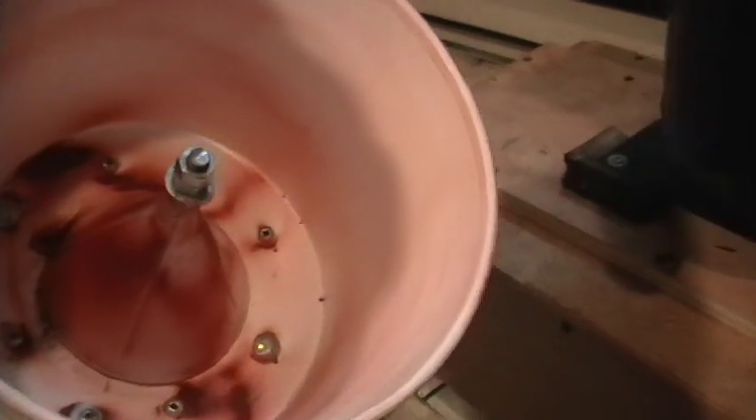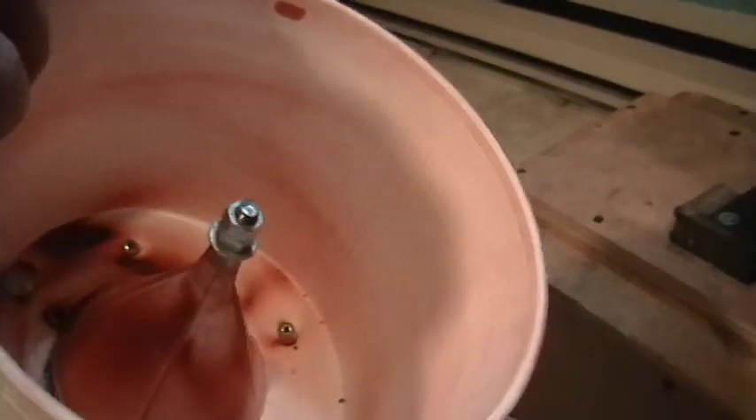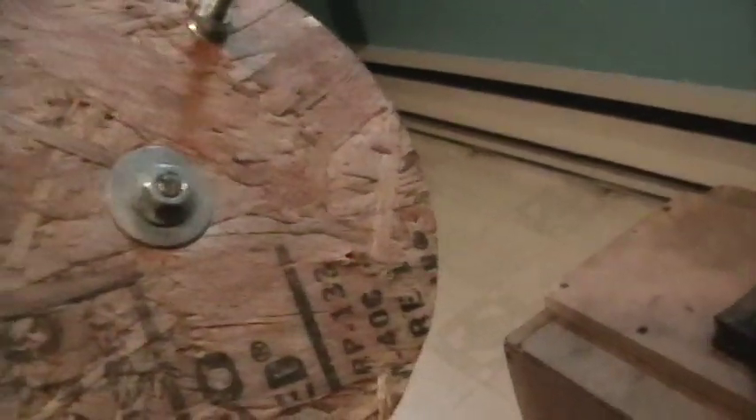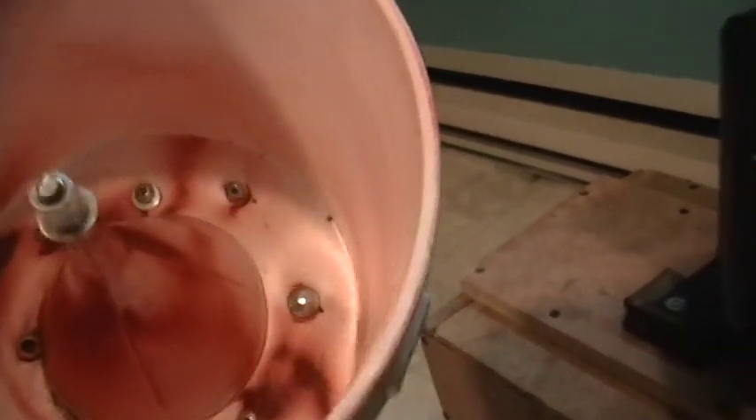The only other thing you need is your bucket — about a two or three liter bucket. Down inside there's a funnel turned upside down; any size would work. You put a piece of threaded rod down through the center of it, put some nuts on top, and bolt it through the plywood on the bottom of the bucket. Then bolt the bucket to that plywood, and put a couple of extended bolts through the bucket as pins that line up with two holes drilled into the top platform.